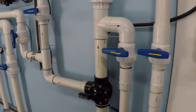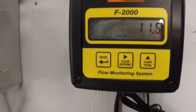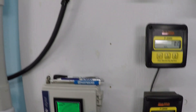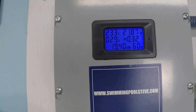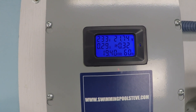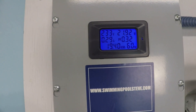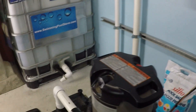The flow rate right now is 11.6 to 11.7 gallons per minute. We'll also look at power consumption with an external wattage meter. Currently reading just about 22 watts of power, 0.29 amps at 230 volts — which is a very, very small amount of power.